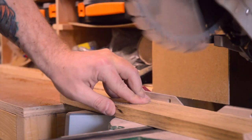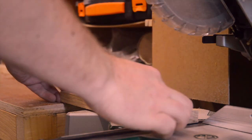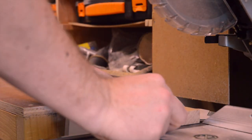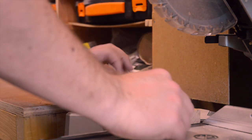After tidying the stock up on the table saw to ensure all the same width, I cut all the pieces to the same length until I got to the oak. Once it was the right length I then cut it in half to allow the channel for the mallet handle to fit inside the mallet head.